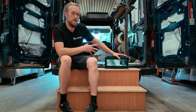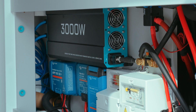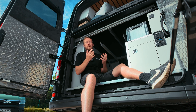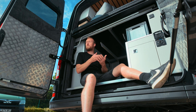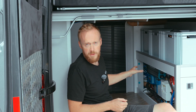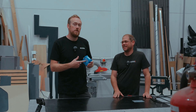If you want to draw 240 volts from your setup, you're going to need an inverter. It draws 12 volts from your existing battery setup and converts it into 240 volts for the 13-amp household sockets in the van. This lets you use any products that need a three-pin plug — laptops, hair dryers, and so on. If you have an induction hob, you're going to need a large inverter. The size depends on the products you want to power — it will say on the back how much power it draws. We've fitted a 3000-watt inverter in this van because it's a gasless van with an induction hob.